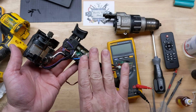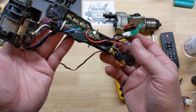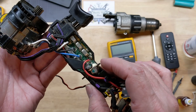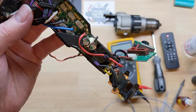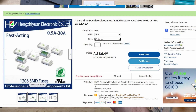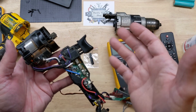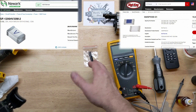Okay guys, back with this cleaned up and back together. I didn't show the disassembly and reassembly today since I did that in a previous video on the troubleshooting and repair. But you can see that 30 amp fuse — they replaced with a Z marking instead of the V — just the ones I chose to get off of eBay: 1206 30 amp SMD fuses. Since shipping was so high from Digi-Key and Newark, I went this route, but if you'd rather get them from there, I totally understand. I'll have links in the description for both options.